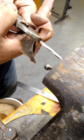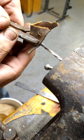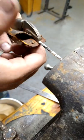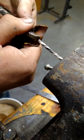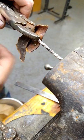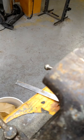Now, I do this ultra slowly. You can go a lot faster. I do it ultra slowly because I want to hear and feel and see anything that might occur. Any vibration, any ping, any noise at all. Anything that sounds like a string snapping, any delaminations, anything at all, okay? And I anneal constantly. So, I'm going to take that out.